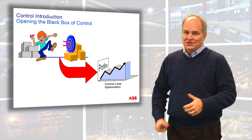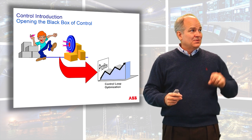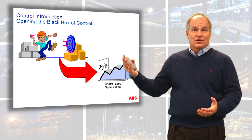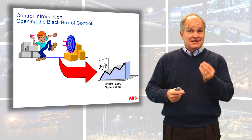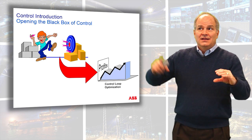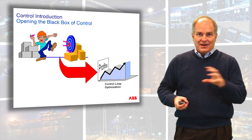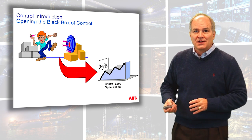Technology changes, and over my nearly 30-year career it has changed dramatically — from single loop controllers to chart recorders to controllers that would fill an entire room. We've gone from maybe a dozen controllers on a process to 400 controllers on a process, but our knowledge of how to tune systems doesn't change. The control theory, the applications, the mathematics behind this is constant. As we get faster controllers and faster actuators, we can do more with control than ever thought possible. But the fundamentals — feedback controllers, PID, feedback control loops — are what we're covering here in single loop control methods.